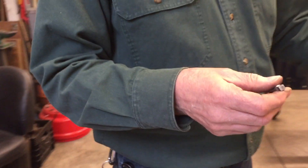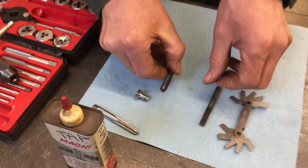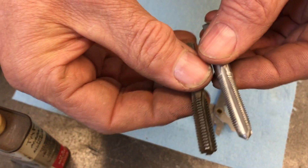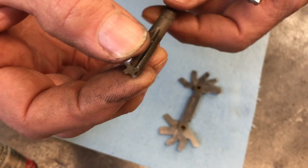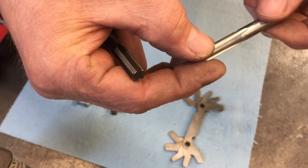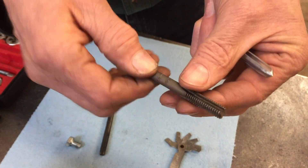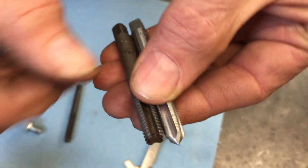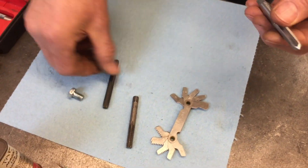I've already drilled a hole at 17/64 in this piece of metal, so we're going to tap a hole and I'll show you how. I did want to mention there are different kinds of taps. This one here kind of comes to a point — that's your standard tap. This one here is flat on the front and is called a bottoming tap. You would use that for a blind hole — something that didn't go all the way through the material. If you wanted the threads to go a little deeper, you'd use the bottoming tap to get one or two more threads toward the bottom. So: bottoming tap, standard tap — just wanted to show you the difference so you'd recognize them.